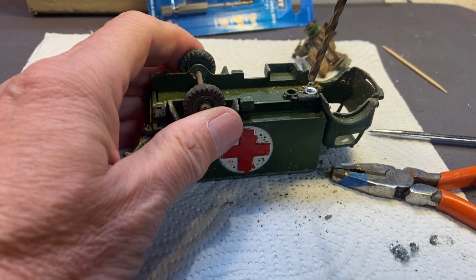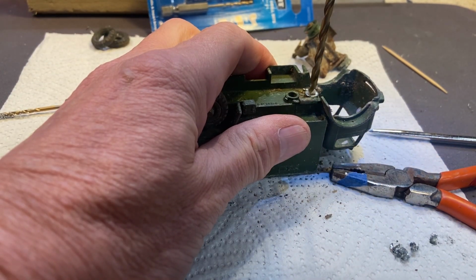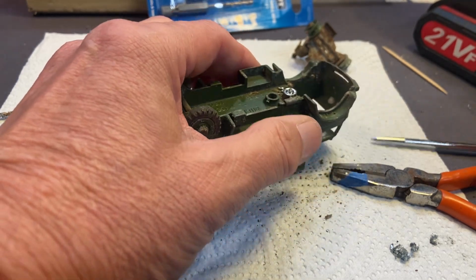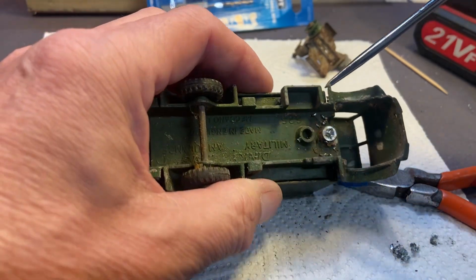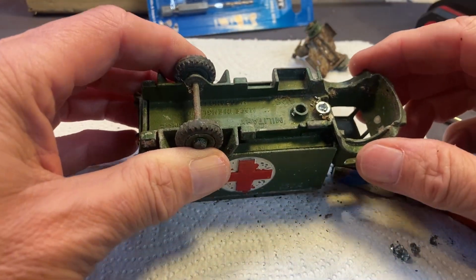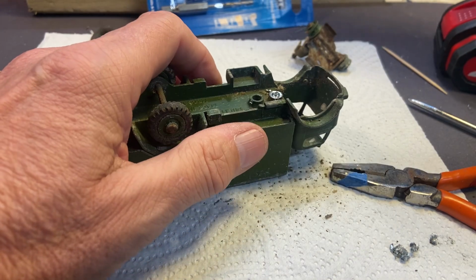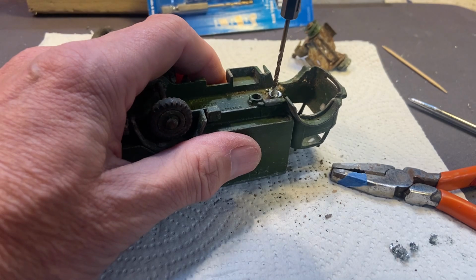Okay, we've got a 3.5mm drill. I think I'd have preferred a 3, but I haven't got one, so let's just take it slowly. And it's quite an old drill and it's quite blunt, but has it just freed it up enough to come off? Tell you what, I have got a 4mm drill. I think I might have to put that down there, see how that goes. Right, before I move up to a bigger drill, I'm just going a bit deeper with that first drill.